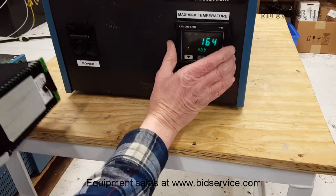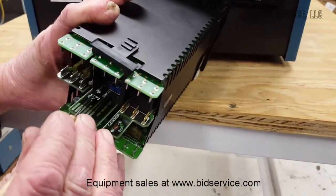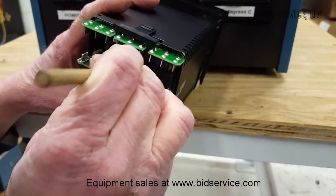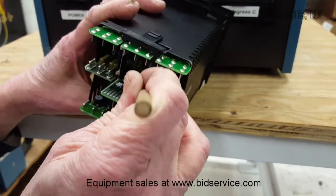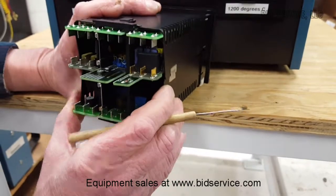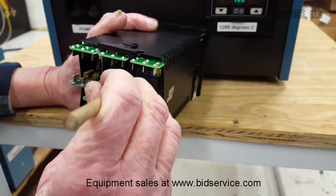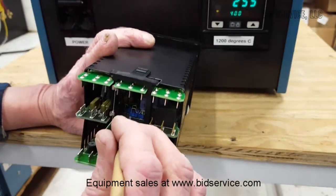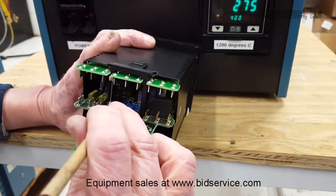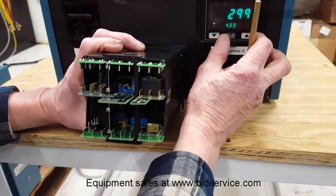Under normal operation this is not removed, but if it is slid out and you look carefully in the back, you'll see where it's written 'security' and 'configuration'. When you drop the switch down into configuration by locking it in place, it will null out the operation so it won't heat the furnace, but it will allow you to set the different parameters including the set point limits. Once you do that and the switch is returned back to security, the operators will not be able to change the set point.